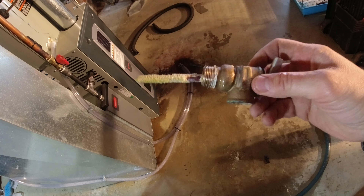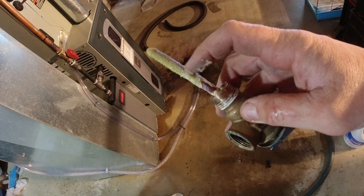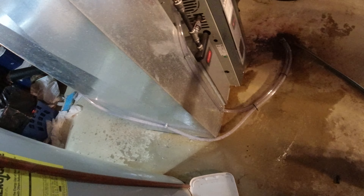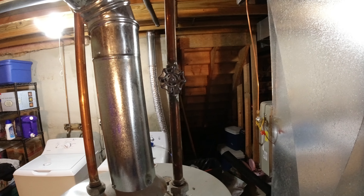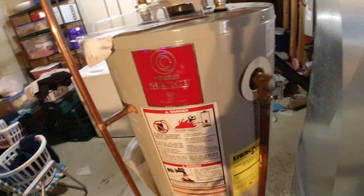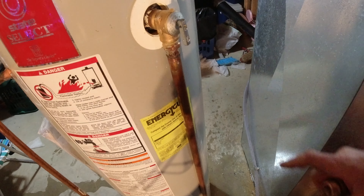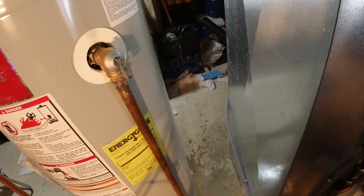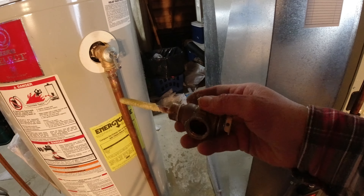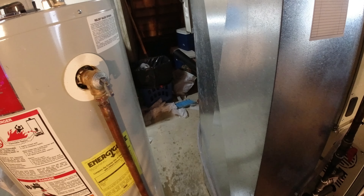So that was another Holmes How Do I. We just changed the faulty pop-off valve - you can see it's got a ton of calcium and mineral buildup over the years. Shut off your hot water feed line, turn off the main, drain the tank a little bit to get it down below the valve level. Then just put the new one back in place. Parts are 15 to 20 dollars, and it'll take you longer to drain the water than it will to do the actual work.